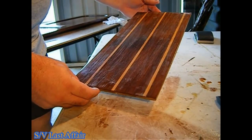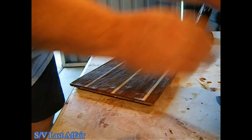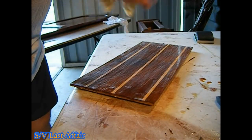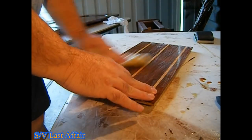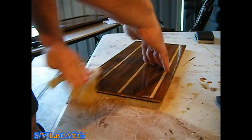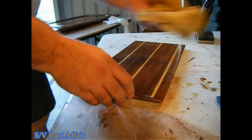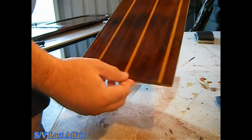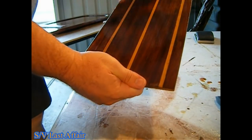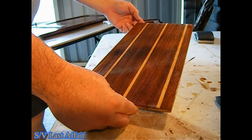You can see it has a bit of a milky white color where it's scuffed up the varnish. We'll take our tack cloth — these are absolutely sticky when you first get them — and wipe down with the grain, just removing the sanded-off dust. It still has a little milky white finish in some areas, but you can see it's ready to go.